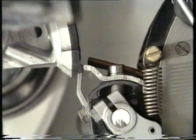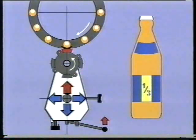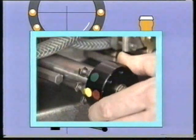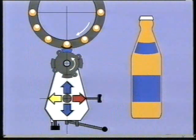If the body or shoulder label are not positioned correctly before being brushed, the gripper adjustment must be checked. The spacing between the anvil and pallet should be specially checked, also the finger adjustment using a label. If only the shoulder labels are slanted, the following principle is true for the setting of the cross slide: the aggregate is driven toward the bottle so that about one-third of the label surface is pressed on by the gripper sponge. The position of the screw for these bottle guide parts at the stop pin should be corrected if necessary.